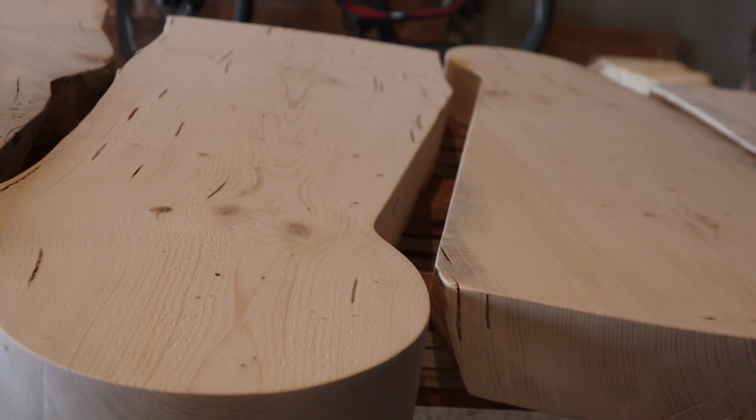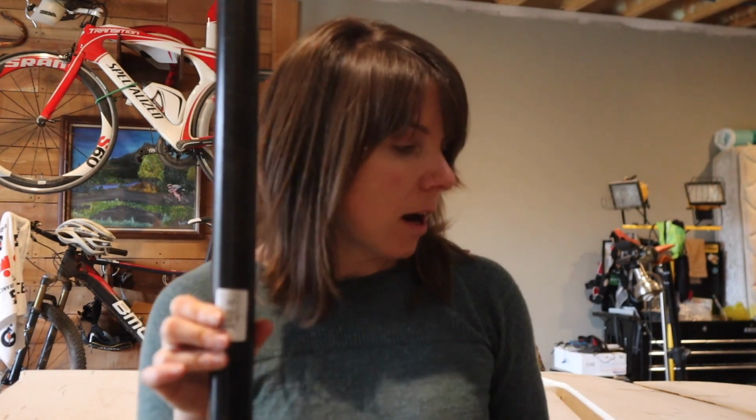But let me show you the pieces that go together. Right here we have the steel pipe that we're gonna be using for stacking these all together and lining them all up. I was imagining like a 4 or 6 inch pipe, but Bryan's actually doing it with this 1.5 inch pipe. It's gonna go through the center of the circled area there. And then each stair tread is gonna lie on top of each other. So there's gonna be touching overlap for the entire stair tread. So there is that support. It's not just on this fulcrum piece on the very end of the stair. And we have some other pieces that I want Bryan to explain, about how it's gonna get secured to the floor.